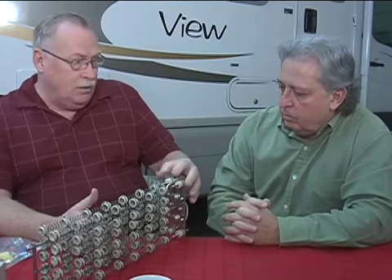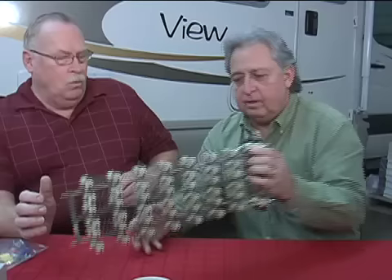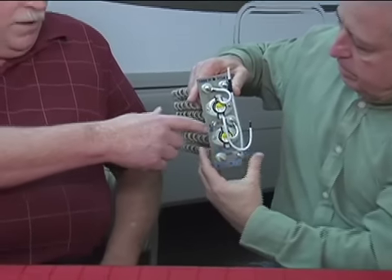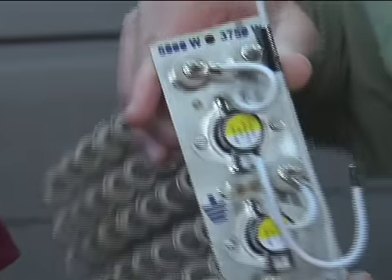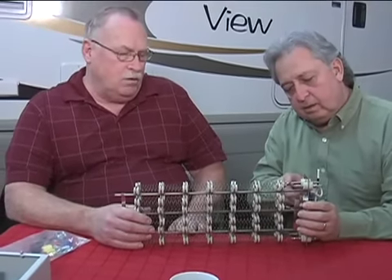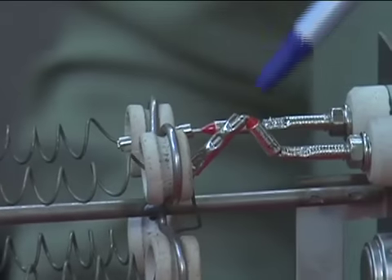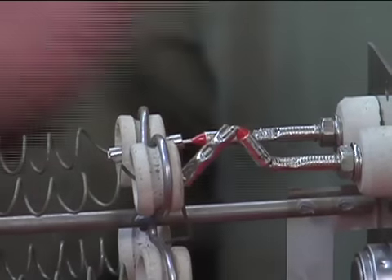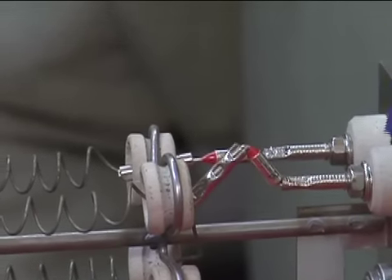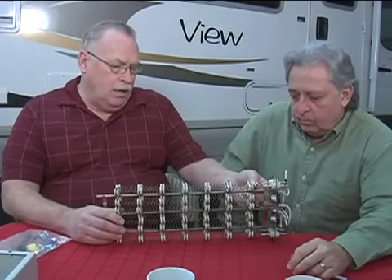Unlike electric plug-in heaters, this system has redundant safety. It has two automatic high-limit temperature switches that at 200 degrees will shut the system down — if one fails, the other kicks in. And if those fail, there are fusible links inside the panel that look like little diodes. At 333 degrees, these internally open up and shut the system down. It's not a resettable fusible link, so once it's gone the entire coil assembly has to be sent back and replaced. If you close off all the registers or the fan fails, these will burn through internally and won't cause a fire.